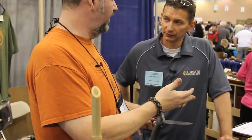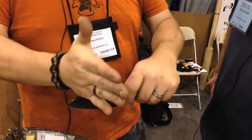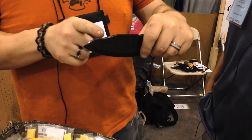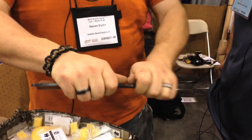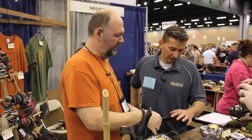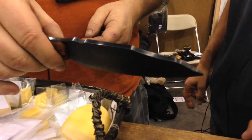It's a very utilitarian blade shape — I took features of knives I really liked and mixed them together. What I'm calling the anvil here is used for when you're using a hammer stick to baton through a piece of wood. Clip point style knives are excellent at batoning because of that clip but weak at the tip, so I basically overlaid that profile to give the anvil. Now you get all that directed force, and it also gives you a secondary handhold for scraping or fine work — you can choke up and lock your hand in so it doesn't slide out. You have almost the full width of the spine right out to the point, which makes it really strong.